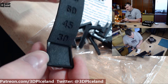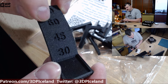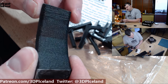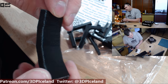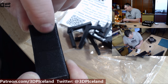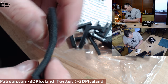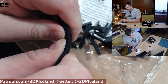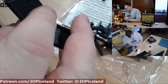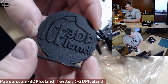The surface finish on the top side was very excellent — a really nice matte finish with very good looks. The overhangs even at 70 degrees came out pretty good. There was a little bit of difference in surface finish from 60 to 70 degrees, but not a significant issue. It came out excellent and is very stiff and very difficult to break.